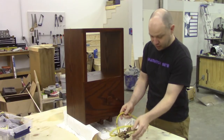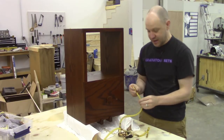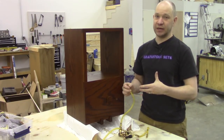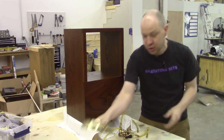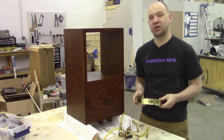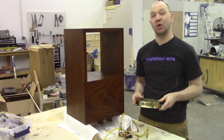It's going to mount up under there. You will have to blow into one of your hoses that you get from some other point in the game. That will go up inside the box and blow on a fan. The microcontroller will measure how fast that fan is going and then move a gauge accordingly, and if you can maintain the right pressure for the right amount of time, you will receive fabulous prizes.